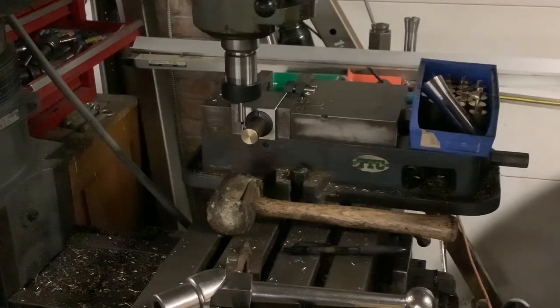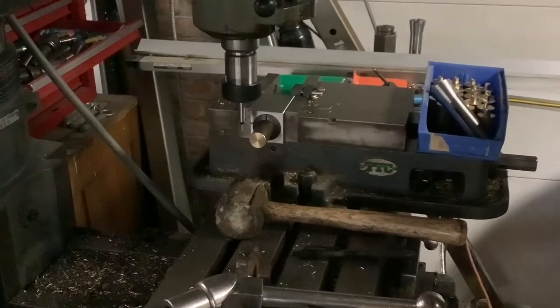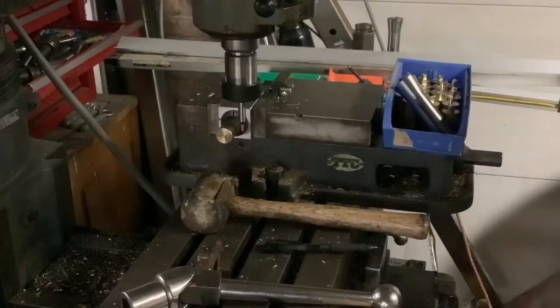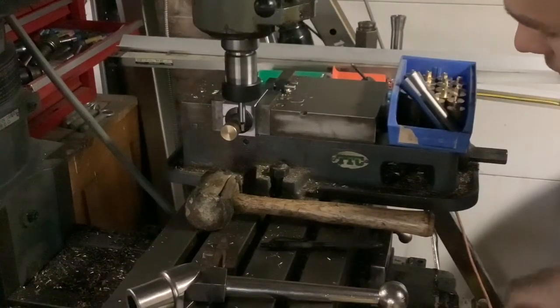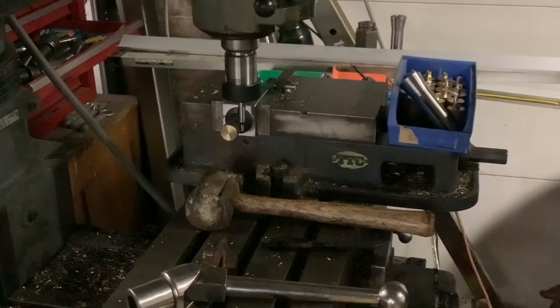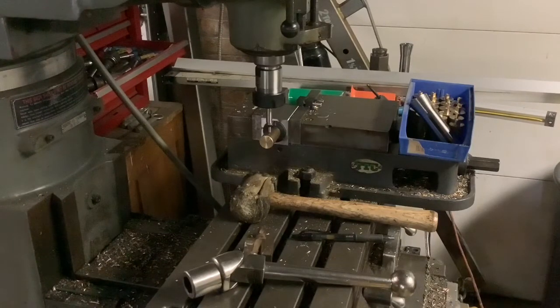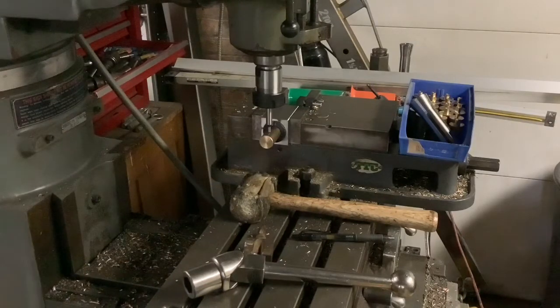So it went out, coming to zero, back up. We're going to do it again. So, 10715 — we've found that center. I'm just going to do a sanity check visually, using the center finder, bring it to home, just looking at the dimples — that looks good, that looks on center. Our X is trimmed in, and now we have to do our Y offset.